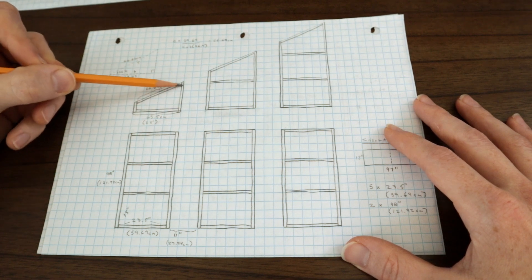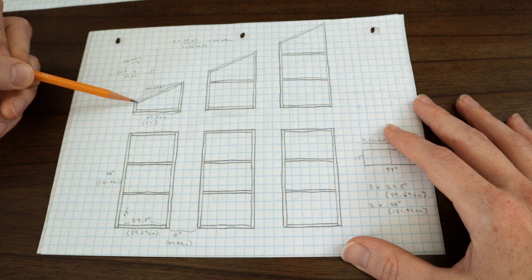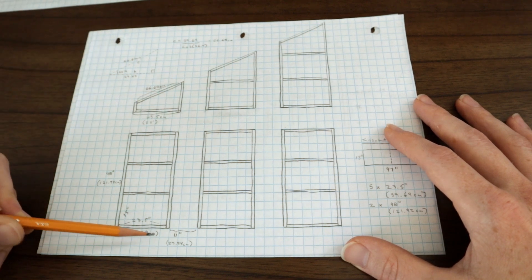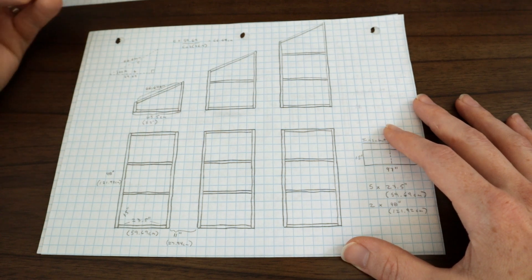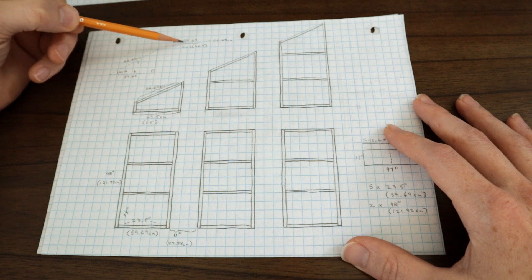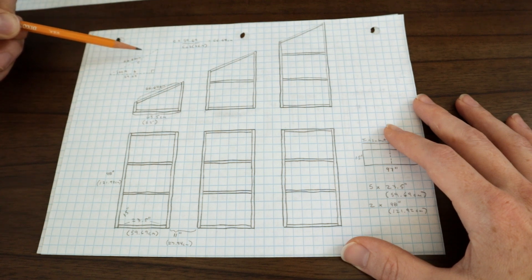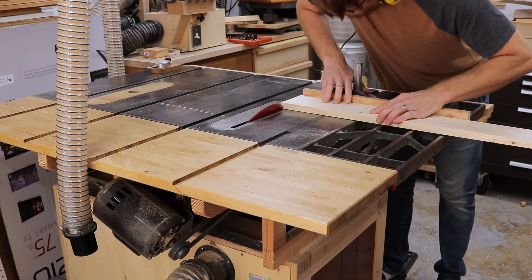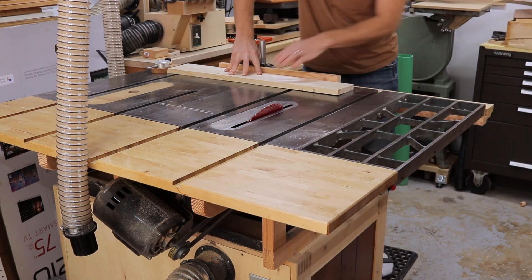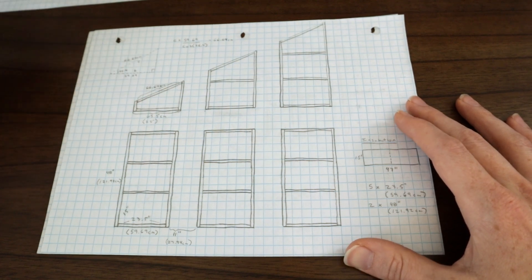I don't want the total width because it has boards on the outside. What I want is to go from the inside, which is 59.69 centimeters. So I know my B length is 59.69 cm and the angle is 26.4 degrees. From that I can figure out C equals B over cosine of angle A, which gives me 66.64 centimeters. So I need a piece that is 66.64 centimeters cut at 63.6 degrees on each end to get this first top part.